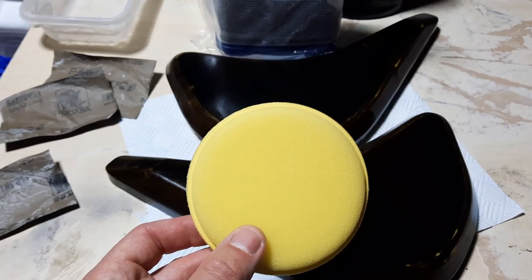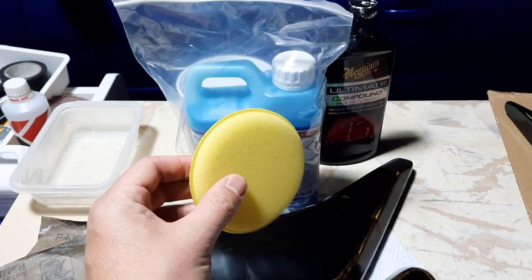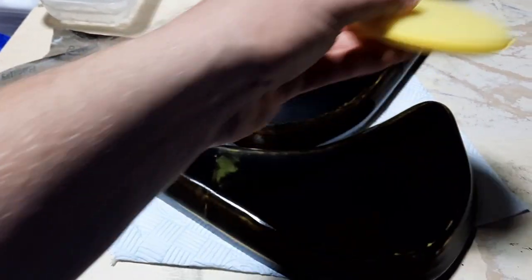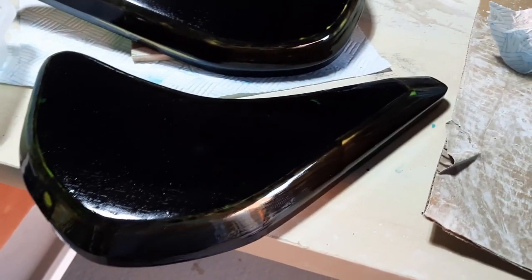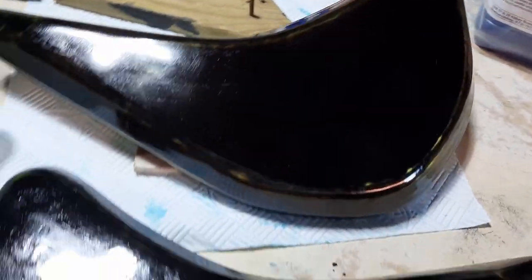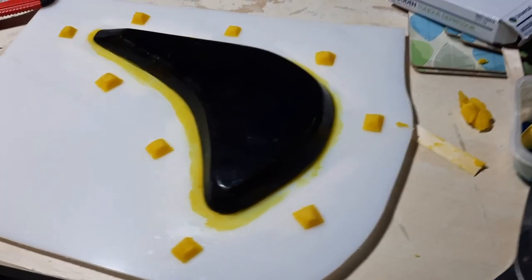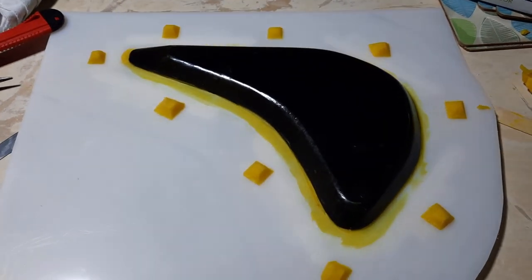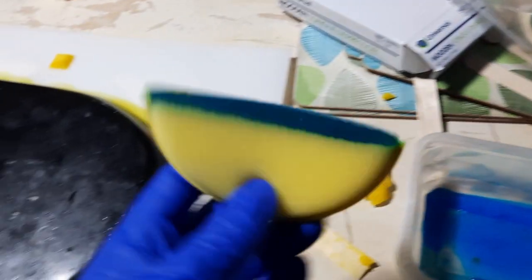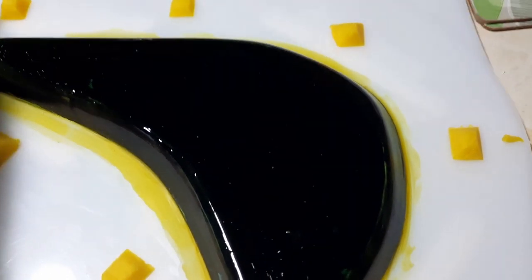Because of belts and braces and the pain I've felt in the past trying to take a mold, I'm also going to use some PVA release agent - not to be confused with PVA glue, this is polyvinyl alcohol. You wipe it onto the surface, the alcohol evaporates and leaves behind a very thin film on the surface. The next step is to make a barrier using a polypropylene sheet and some soft wax to close any gaps, giving the whole thing a generous wipe over with that PVA release agent.